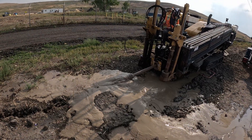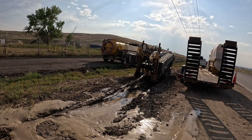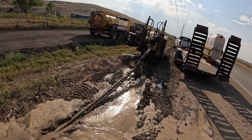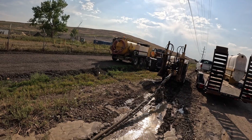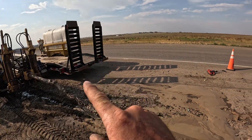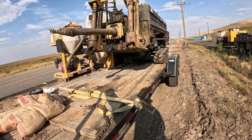Here it comes. There's our reels of pipe — we just got to get it all the way back there and then we can be done for the day. We sort of took a risk on this one because there's clay under there, and Dane ran out of water in his main tank, so we ended up using the water on the back. We ran out of that one too, and used just plain water — no mix in it. That's risky because if there's clay, it'll squeeze down on the conduit and eventually break it off. But that did not happen today because we did have some mix from that tank in the hole. Alright, go ahead and cut them off, and we can get ready to go — unhooked, loaded, and vamonos.